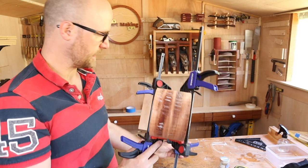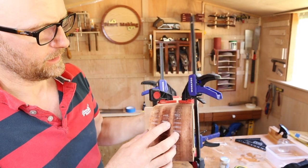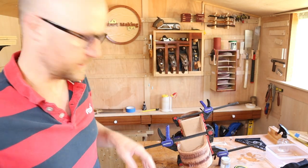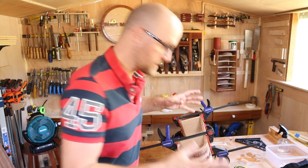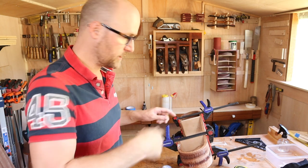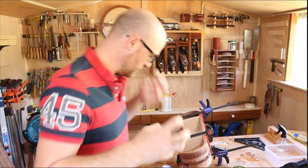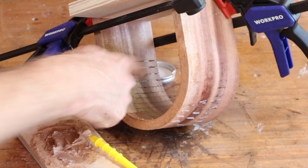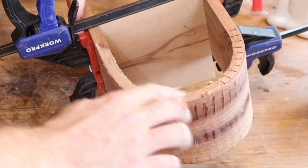I found out I'd run out of the thin CA glue so I've stabilised all of the little cracks just by putting a thick layer of it on and spraying it with the activator. Hopefully that'll just hold them from splitting any further. I'm going to try and attack the kerfs that haven't filled. Luckily I'm a bit of a hoarder and any time I do some fine sanding I collect up all the clean sawdust. I'm going to make my own wood filler out of this with wood glue, mix it all together and feed it into those grooves so instead of the glue just disappearing it will be held by the wood filler. The wood filler goes into the gaps really nicely - I just figured this would give it a lot more strength.